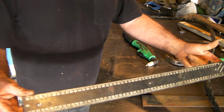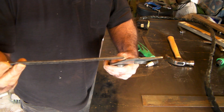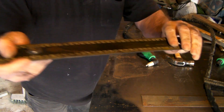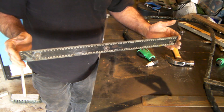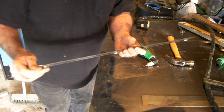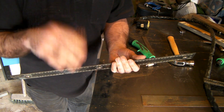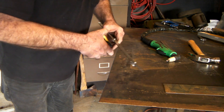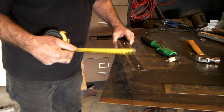The best tool I ever made was this. I found an old square ruler at the dump — it was damaged on the edge so I cut it off, still nice and straight. I got some magnets and pop-riveted them onto the ruler. If I was making another one I'd make it twice as long, especially for long cuts, but even for shorter lengths this is brilliant — you don't need those stupid clamps. And because it's offset off the steel, the sparks fly in between the magnet and the ruler — you don't get debris in your eyes.